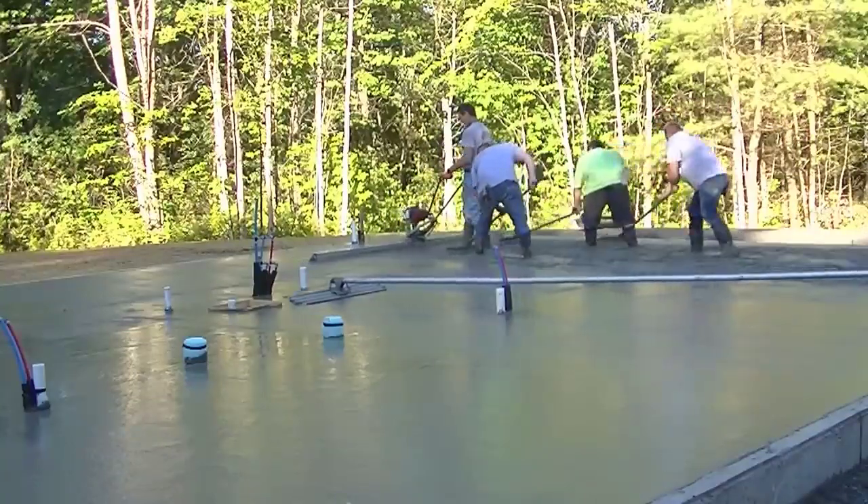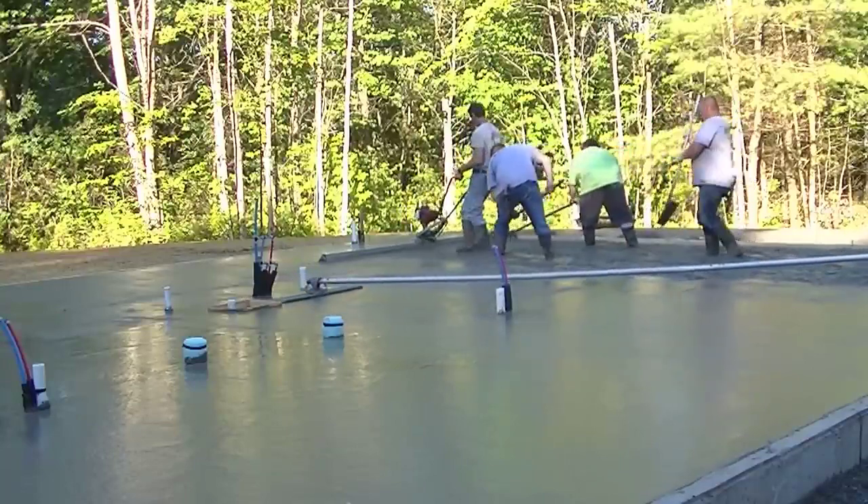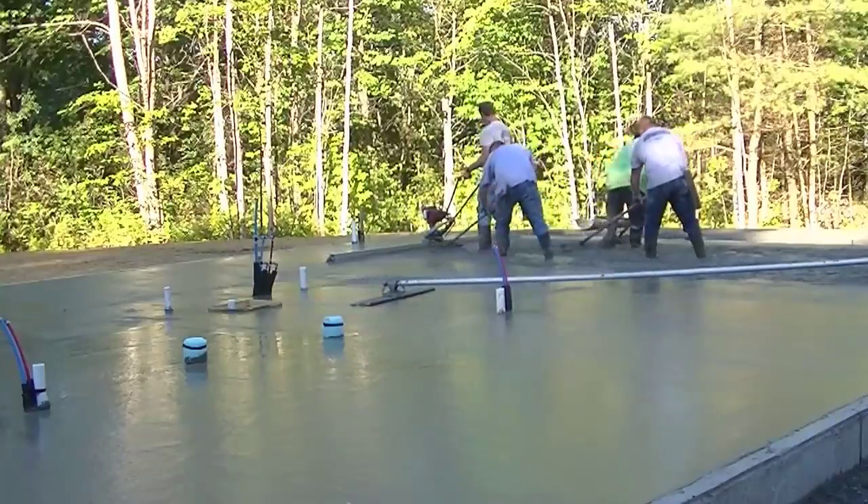You can see Tia is bull floating right there — there isn't a ton of effort involved in bull floating that, especially when you pour a six-inch slump, a good workable slump.